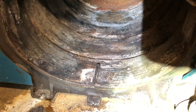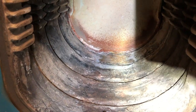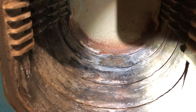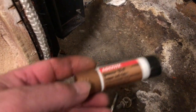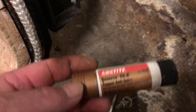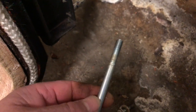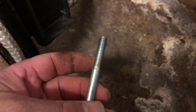It's much cleaner than what it was, but some of this stuff is very, very hard to get off — the amount of stuff in there was really difficult. What I'll usually use is a wire brush on my drill. I got the new rope gasket installed. Another quick tip: whenever you put the bolts in the door on these boilers, make sure you use an anti-seize on the threads. Otherwise these bolts can get seized in the side of the boiler, break off, and then you have to tap them out — and that's never any fun. Just put a little bit on the threads and then they'll be able to come off next year.